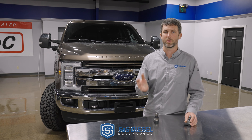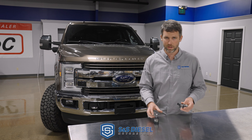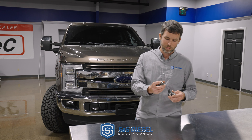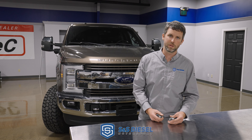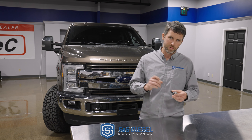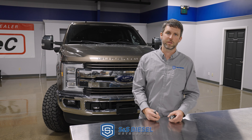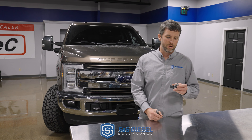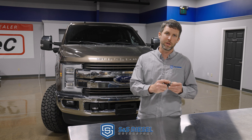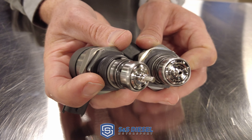Because there was so much rust in the system, that screen was plugged up on the old one. As another test, we ended up removing the screen off of that DRV and we're reusing the old DRV as well. We know there's still some rust in the system — we left most of the old lines and a lot of the rest of this stuff just to continue to put the pump through its paces. To keep from plugging it up again, we just clipped the screen off, as you can see here.